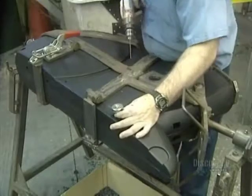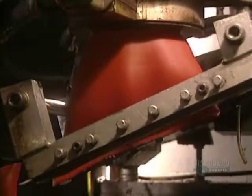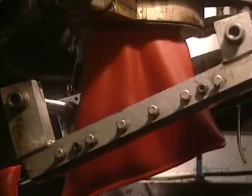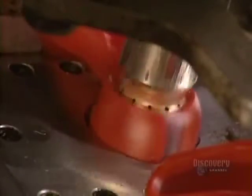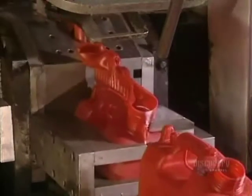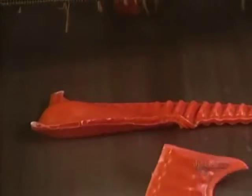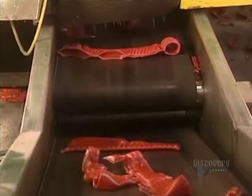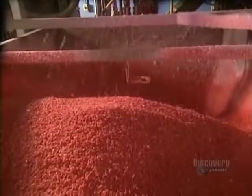Holes are made with a drill and the casing is now completed. Now we get back to the previous blow-molding process. This type of molding produces residues which have to be eliminated; these surplus pieces are cut with a small saw. The now-hardened scraps are sent to the granulator to be reduced into granules, which will be newly added into the mixer to make other plastic containers.